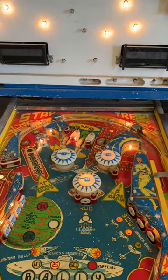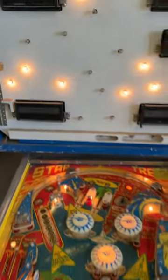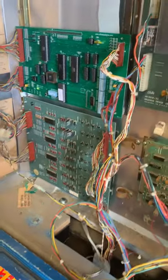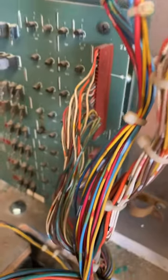There's still some work left to do. We need to replace all of these rubbers. These displays need to have their connections reflowed because some of them are a little iffy. I'll order a connector rebuild kit and ask the owner if they want to upgrade to LEDs — if so, I'll need adapters because this lamp driver won't work with LEDs without one.